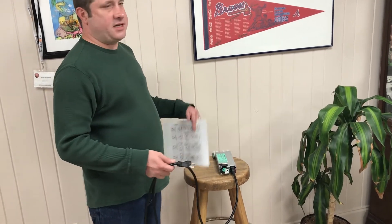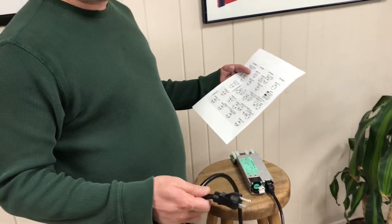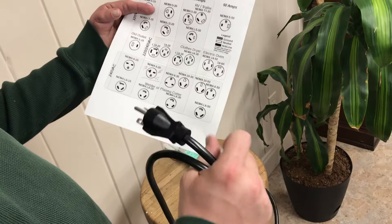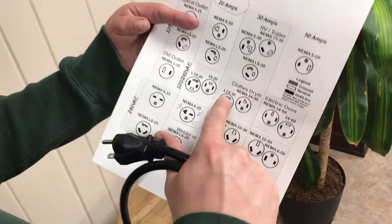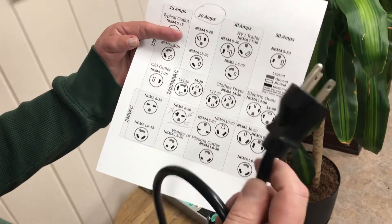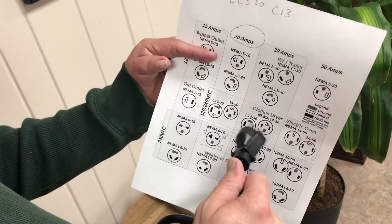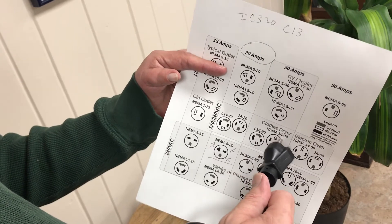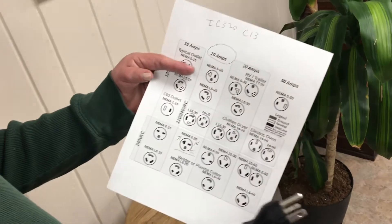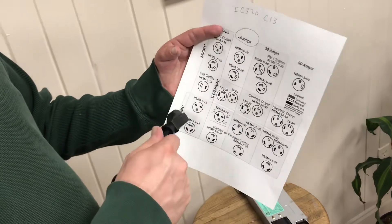I know this might be technical — you might need an electrician to explain some of this. I did. I'm lucky because I have a brother who is an electrician, so I ran a lot of this by him before I purchased. You probably have to have these cables made. But if you have a clothes dryer or an oven, you could make a connection to your dryer outlet — that's this end, as long as the other end is the C13. Something like the L14-30 or NEMA 14-30 is pretty standard for clothes dryers.